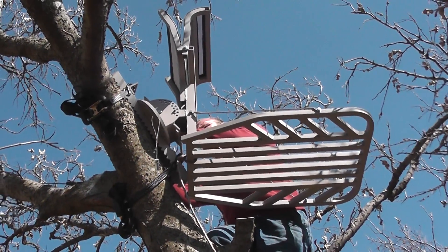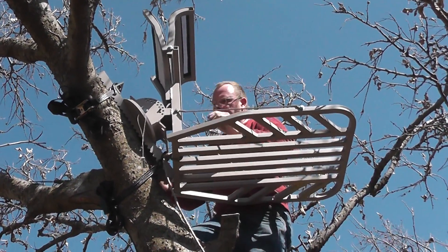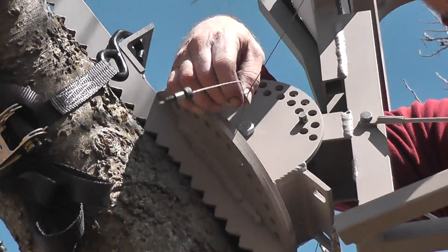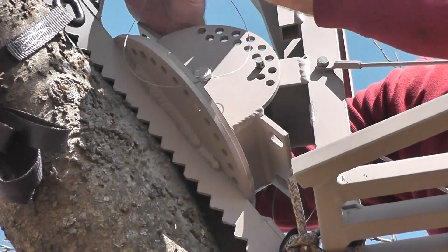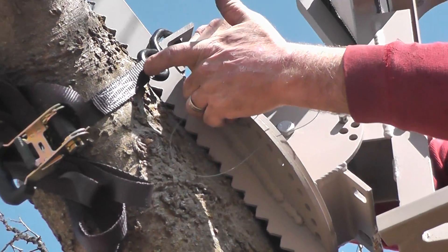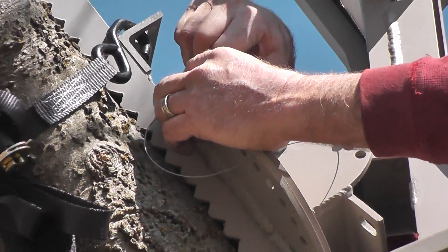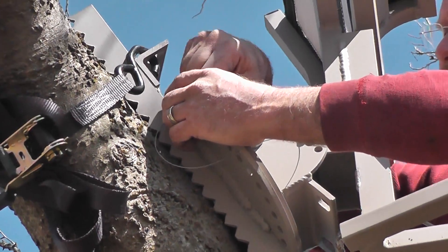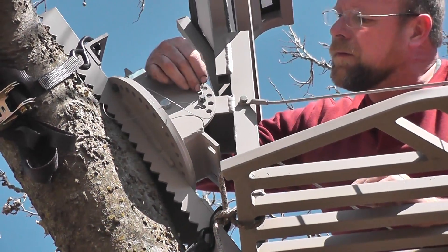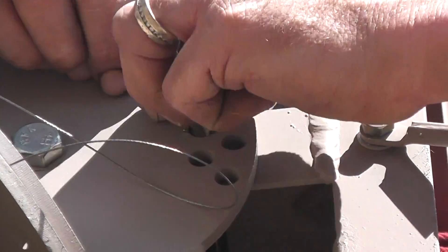What are you doing now? Putting in the safety bolts for the rotator. What he's doing here is putting shoulder bolts into the swivel mechanism to keep it from rotating on him, and he's only putting them hand tight. This is to keep the mechanism from flexing. He's putting his clips in his pins to make sure they don't walk out.